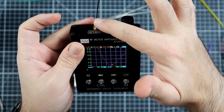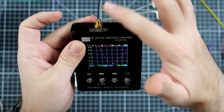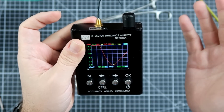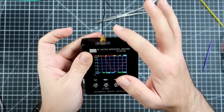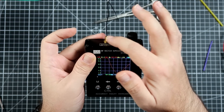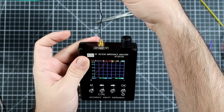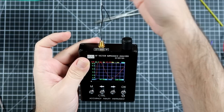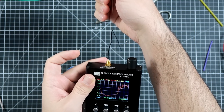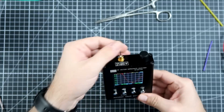And now look — I touched the ground. Yes, the tune moved by like 5 to 7 MHz. It is almost not a difference. The measurements of the device will slightly change if you touch the ground wire, but only slightly. If I touch not the ground but the hot wire, the measurements go way off — look, I'm just slightly covering the hot wire with my hand and look what's happening with the tuner. Completely, completely different thing.